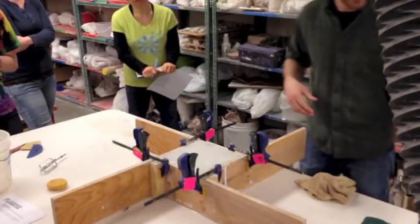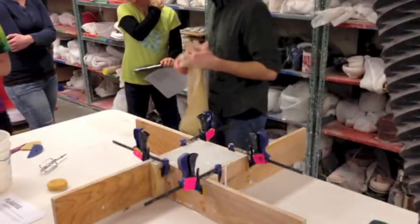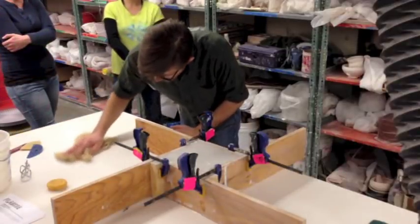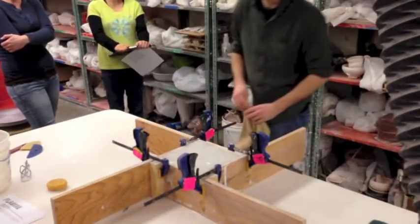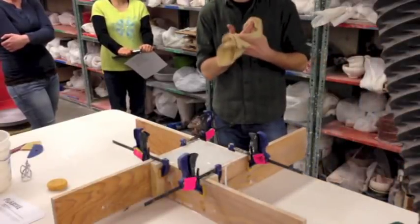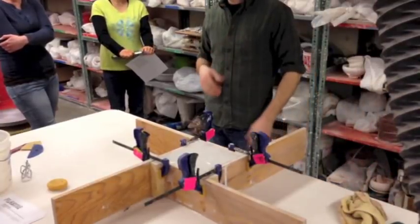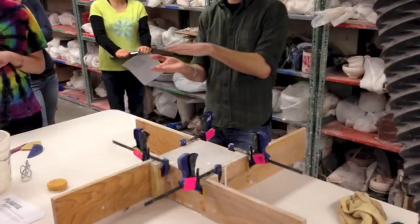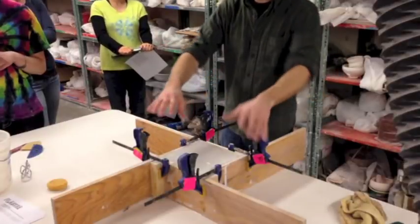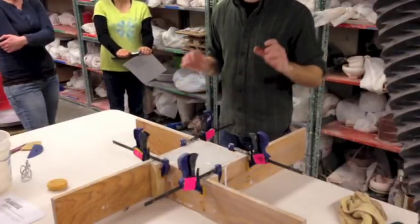I like to give it a spray. If you have clay in the bottom on the inside and you're casting onto the table - so plaster is hitting the table - rumbling it around is a risk, but I think you should still do it a little bit. If you're casting straight on the table and you're rumbling the table, there's a chance that seal is going to break. I'm not going onto the table, so I could actually move this whole thing around with much less risk.